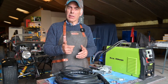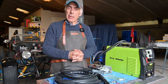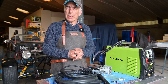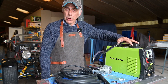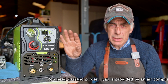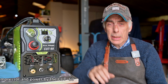In nature we have four states of material: gas, liquid, solid, and the last one is plasma. Plasma is air which is ionized at very high temperatures — you can compare it to a lightning bolt, that is basically plasma, and that's the technology used in a plasma cutter. We're going to need gas from our shop air at about 6 bar or 90 psi maximum, and the plasma cutter will provide the power.